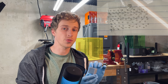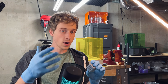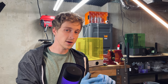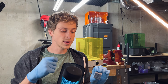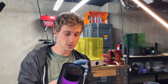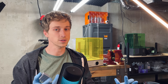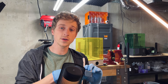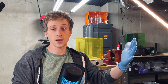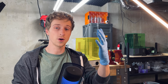The speed of propagation through a material is actually the same as the speed of sound in that medium. For rubber, it's about 200 feet per second. A .22 long rifle subsonic round is going 1,100 feet per second, so it's going to hit the material and pass through it before the material has a chance to disperse the force — making rubber a terrible choice for stopping rounds. Whereas aluminum is about 20,000 feet per second, so as soon as the round hits it, most of the structure can be contributing to stopping the round almost instantaneously.